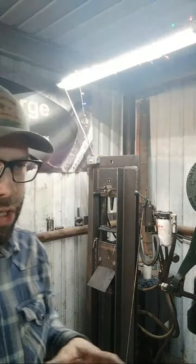And forging, no, you just look at the steel. Any forge is going to have an upper range of temperature, and depending on how much fuel you're putting into it, you can get it to where it runs at a pretty steady temperature. You could leave a piece of steel in the forge, which you don't want to do, and it would just run at whatever temperature the forge is up to and stay there. If you've got to run it really high, which you would do for forge welding, that's not appropriate for general forging. I run at about 5 psi right now on this forge for these hammers, and I can leave the billets in there for however long and they would stay at a certain temperature, which is probably around 1800, 2000 degrees.